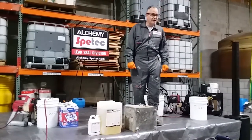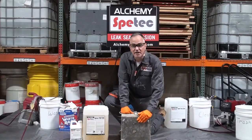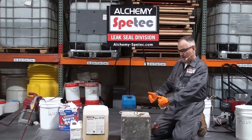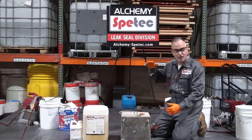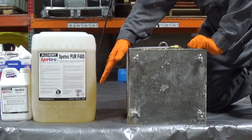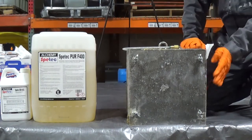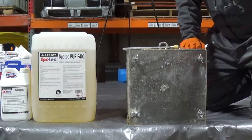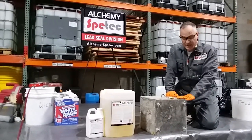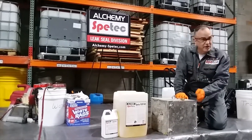I've got our demo block right here in front of me. What this represents is a concrete wall and a concrete joint. Right here I would be on the inside of a basement or subgrade, parking garage. This would be the soil side — the positive side where the water is coming from. This is the negative side where you're standing. The plexiglass represents the concrete that would continue out towards you, and the interface between the plexiglass and the concrete is the joint, defect, or crack that we're going to grout.